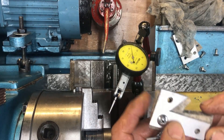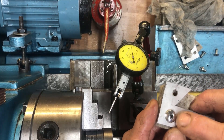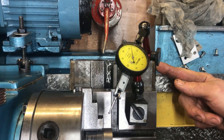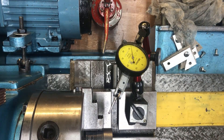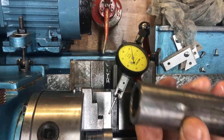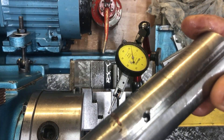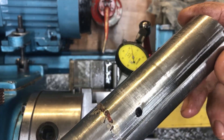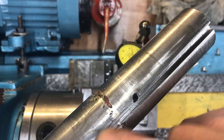A couple of things I didn't mention: on the tailstock wipers, I added an extra screw hole in the plate. I thought that the aluminium bent more easily than the steel, but I think the original steel piece would also need an extra screw, so I might do that. Also, I just lengthened the keyway in the tailstock — the extension there. I overlooked the hole that was there from before. Just leftover material I used — simply a milling operation extending that slot.